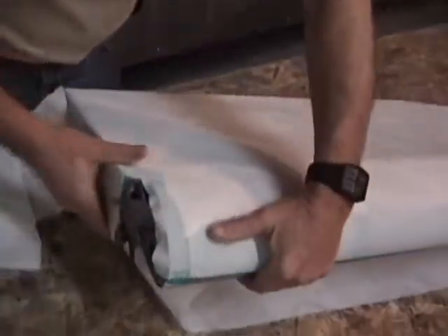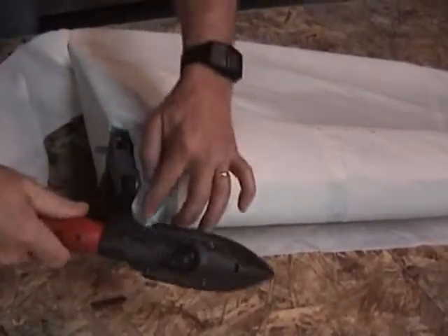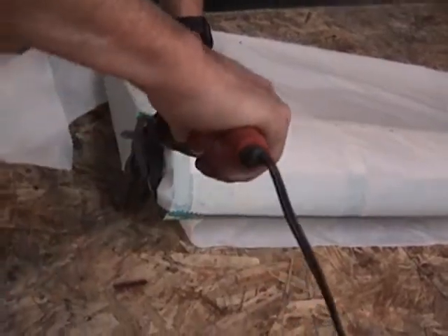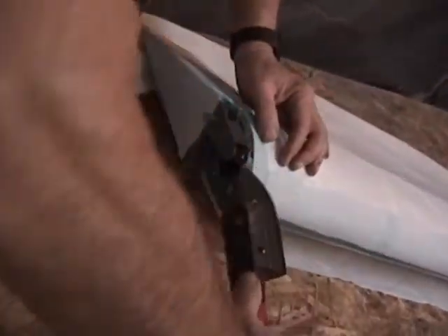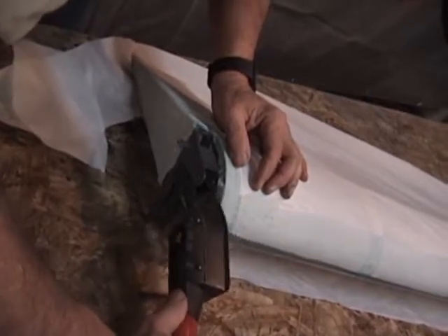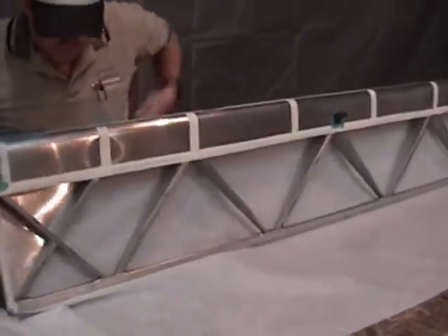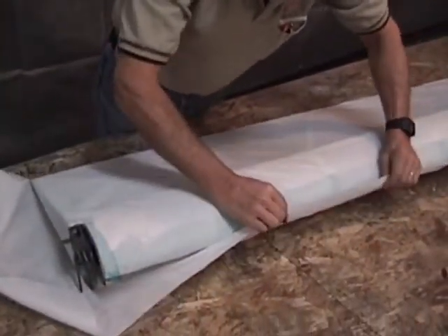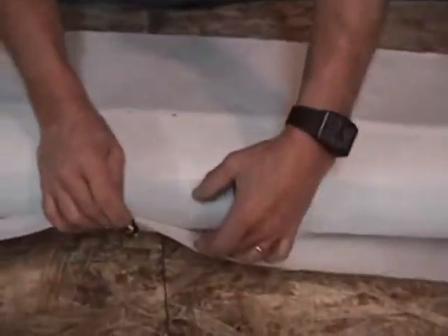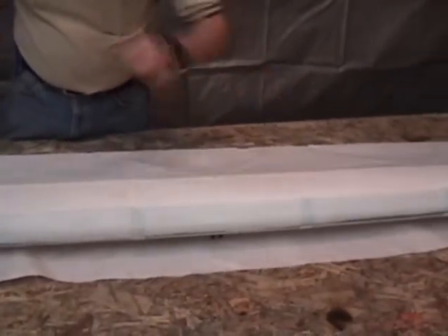It's kind of hard to see here what we're doing — I'll turn it over. See how that was trimmed. There was some glue put on this surface because we knew that was going to be a pretty tight tuck there. With the iron, go ahead and lightly shrink that fabric, then pull it around to get a good little overlap seam. This is going to come on around and pull it into place here. So what we're going to have to do now is brush another coat of glue on here and let it dry just like we did before. Since that's dry, we'll pull the fabric around and show you how to mark it, trim it, and cut it.